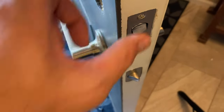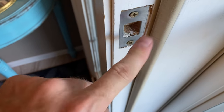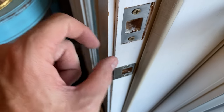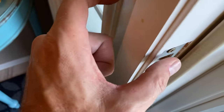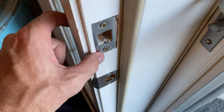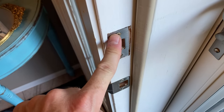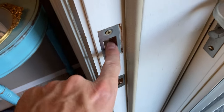I've been calling it the strike plate but that's actually just the deadbolt plate. The actual strike plate is over here on the door frame - and good news, we already have one installed so we don't need to switch it out. A security note: I replaced the original short screws with long two-and-a-half to three-inch deck screws years ago, which adds beefed-up security. As long as the deadbolt aligns and seats properly in there, we're good.